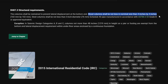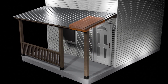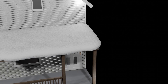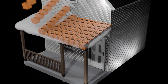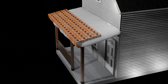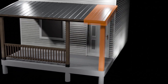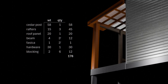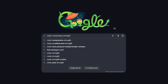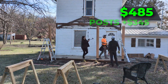Posts need to be at least 4x4, and compression strength ratings are available for most species of lumber. The tributary area for each post is roughly half the porch depth multiplied by the space in between each post. We can multiply that area by our snow load to get the total load each post will need to bear. The snow load in our area is 20 pounds per square foot. About half the load from the porch roof is transferred to the house foundation through the ledger attachment. The remaining load can be divided up into three loads, one for each post — this is our live load. To find our dead load, we can add up the weight of the materials above each post. Let's call our total load for this post 400 pounds. Regardless of the species, timber has a very high compressive strength, so these 6x6 cedar posts are going to hold up just fine. Each post costs about $115, so we paid $345 in total for posts.